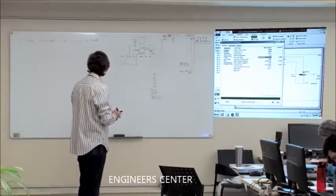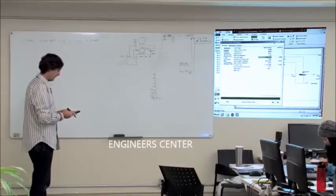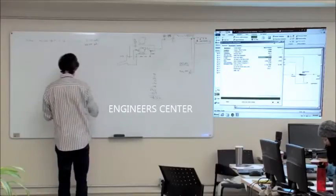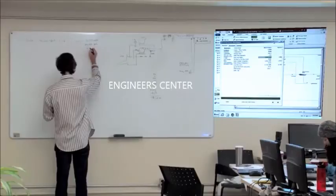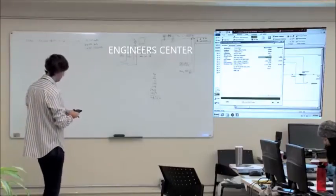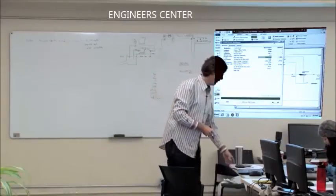Okay, so 56,500 kgs an hour. I'm just going to convert that into US gallons per minute by first multiplying it by 2.2046 to give me it in pounds per hour. So that's 124,500 pounds per hour. And if I divide that by 500, it's actually not that big a flow rate. It's only 250 US gallons per minute. 249. Oh, that's not that big. Surprised it's that small, actually. Just looked like big numbers initially. Okay. So we have our flow rate.